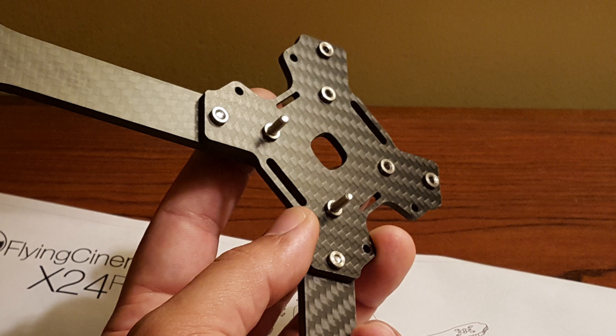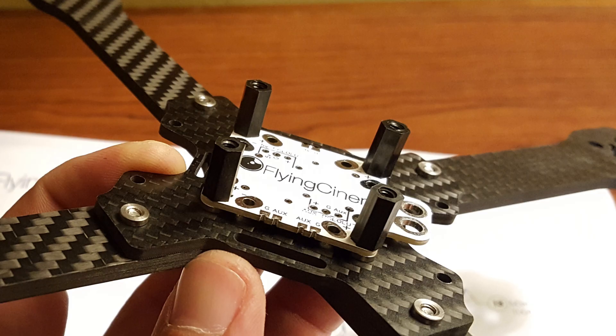That's just a hunch, and this would not be my preference. But for this style of frame, you have to use metal screws to hold the arms in, and it doesn't make sense to have a whole new set of screw holes just for the flight control stack. I am glad the flight controller is on nylon screws. The PDB may be a little more robust, although if you're using an RROSD or other PDB with integrated electronics, it may be taking some hits. Here you can see how the PDB and nylon standoffs go on top of those metal screws.